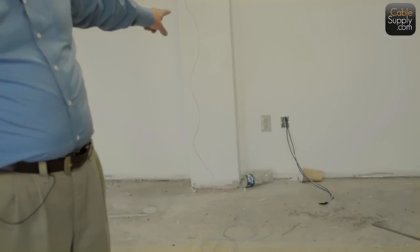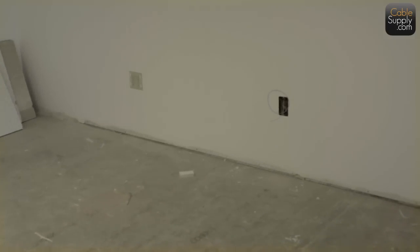All you need to do is just pull the cable, punch it all down nice and neat, and then identify the cable based on where it appears, either on the 66 block or on a patch panel. So this might be patch panel A, port 5. Over here might be patch panel A, port 10. So it doesn't matter, because the person looks at the label and it says A10. They know they can go right back and do A10.